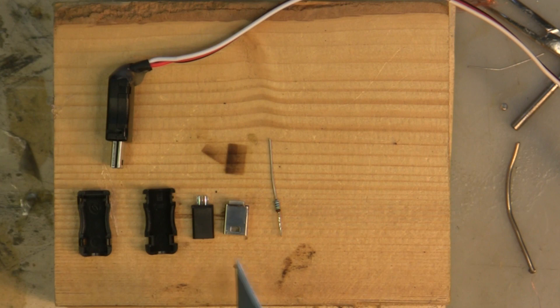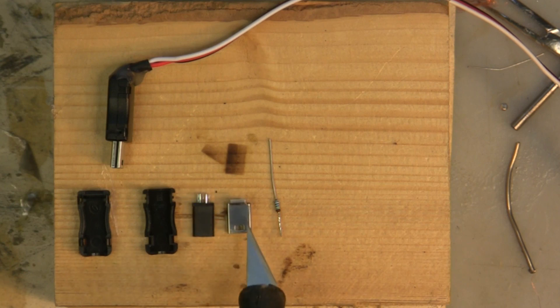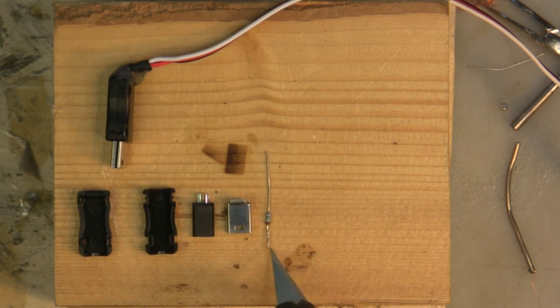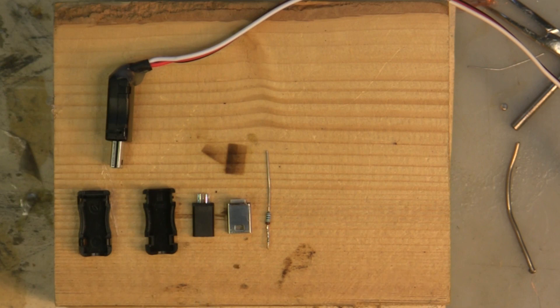For the parts you're going to need for this, you're going to order from chargeconverter.com and I'll put up a copy of their screenshot from their website so you can get the parts. Basically it comes with this outer case, it comes with the inner connector with the pins on it, and it comes with this metal casing that you slip on the outside. Make sure you order the resistor with it because you need the resistor to attach from the ground to one of the ID pins to tell the camera to go into video mode.